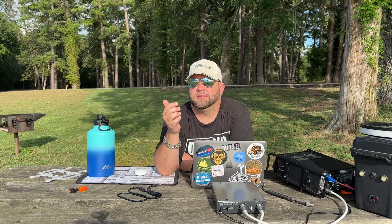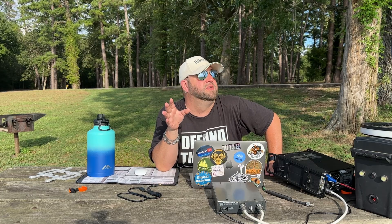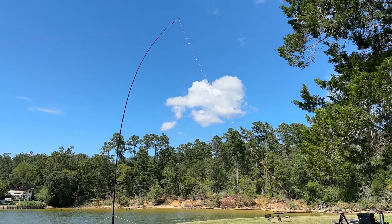On sideband, this thing kicks ass. Changing bands — no problem. You need the tuner, love it. The really only downside would be that Matt says you're not supposed to use a long coax to the balun — the 4-to-1 balun. So that could be an issue if you kind of need to get the antenna away from where you actually are. I'm thinking like field day, or just depending on your topography. You also got to keep the ladder line away from metal. But as a first time user of a doublet antenna, dude, I'm floored with this thing. You've got 90 feet of radiating element in the air, up 8-10 meters or so — I have no idea how high it is, it's not fully extended. It kicks ass! I worked WD4DAN on all four bands that I worked, except for 10 meters. Just absolutely incredible.